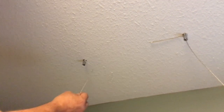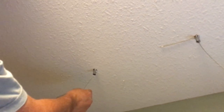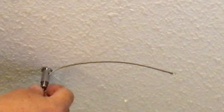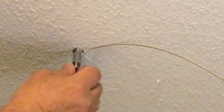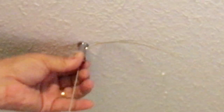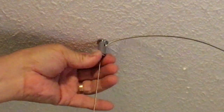To get the wire up through the fittings in the ceiling, it just gets fed into the bottom and out through the little hole in the side. We've oriented these screws that are in the ceiling so those little holes face inwards because of how we're planning to manage the wire. Just pull on the wire until it's about where you want it and then screw the fitting into the screw that comes out of the ceiling.